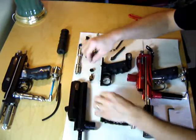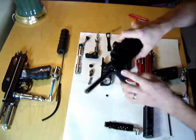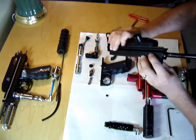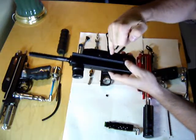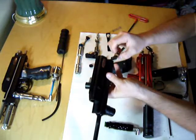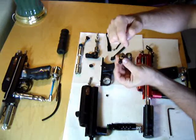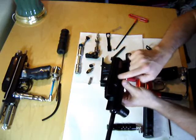So the airflow goes into the ASA, up through the regulator, into the ASA here, and into the front of the gun. From there the valve sits in here and blocks the airflow. The airflow continues back along this way, and right back here there's a hole that goes between these two tubes. Right behind this valve, when the hammer comes and hits it, the air is going to flow up here through the hole drilled between the two tubes and into the body of the gun.